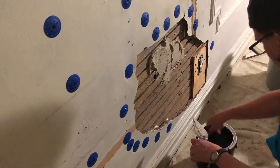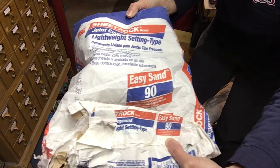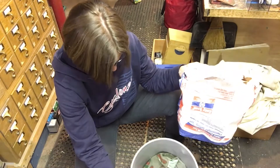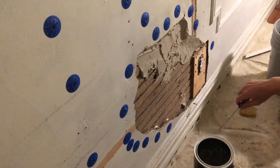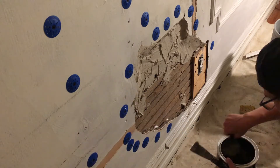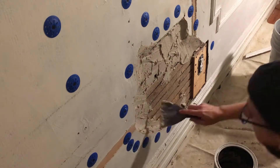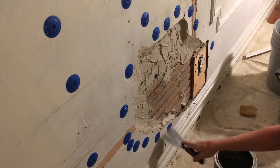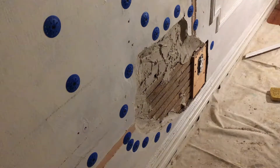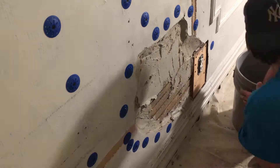Let's talk about the plaster I'm using. This is the scratch coat, or sand coat — I've mixed play sand with plaster. Using a putty knife, I'm trying to push enough of this sandy plaster through the laths so that it sags on the inside of the wall and creates plaster keys that hook the plaster onto the lath, making a solid wall until 90 years from now when someone else repeatedly pushes on the plaster and causes it to break down.